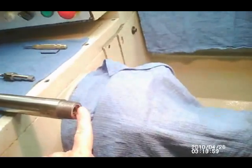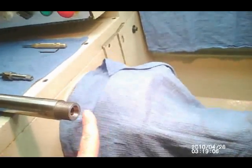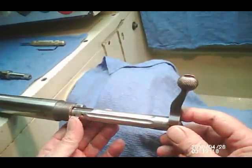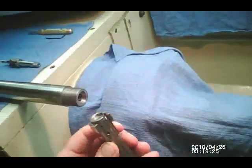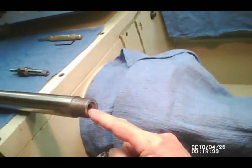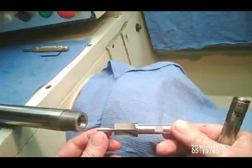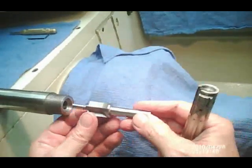The next process in chambering the Remington action is the bolt nose recess. For most standard Remington actions it's between 145 and 150 thousandths in depth and 708 thousandths across. The bolt nose fits in like so — the dimension on the bolt nose is 700 thousandths from one side to the other, and this recess is going to be 708 thousandths, giving four thousandths clearance all the way around. One way to cut this is with a reamer from Dave Kiff at Pacific Tool — exactly 708 thousandths wide, and you only need to control depth of cut.